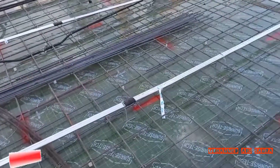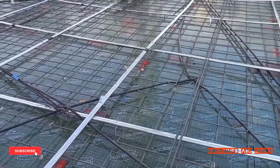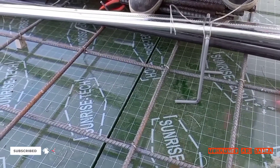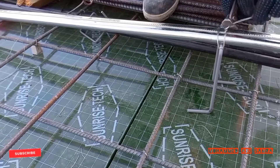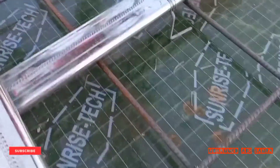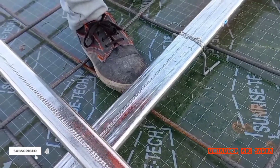For our tendon direction, we should take care as we told about direction — which one up, which one down — as per our design. We install the chair like this in the tendon, then we fix the chair to the shutter by stapler. Before we fix the chair, we should take care about size and right location. This is a big problem if done incorrectly.